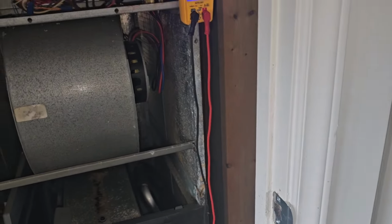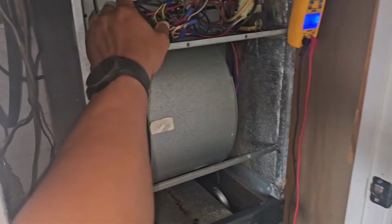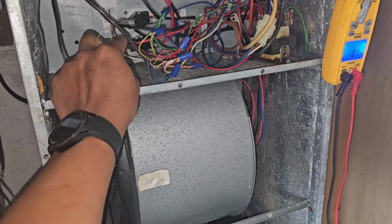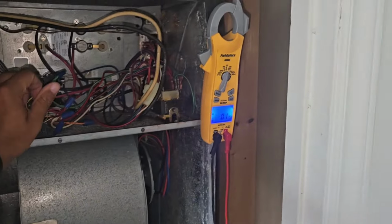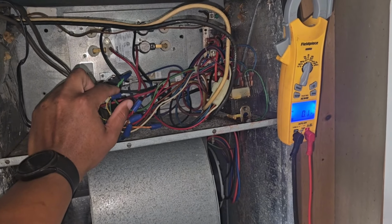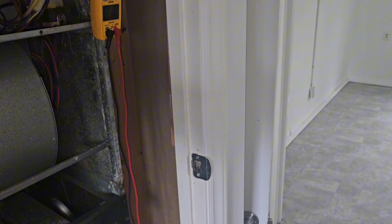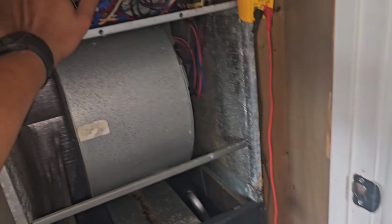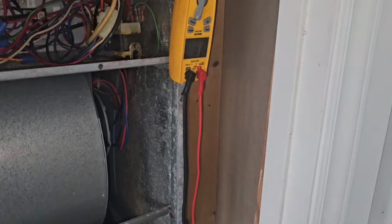You cut the fan on? I think the fan relay on the board is bad. But what happened in heat mode was that the heat strips also energized the blower motor, like the sequencers do, for a certain fan speed, if I'm correct. Some units do, some units don't. It could be controlled still through the fan relay on the board. But that would explain why when we had it in heat mode and we bumped it up, the second stage heat kicked on the heat strips, and the heat strip sequencer kicked on the blower motor. Because that thing was running just like 40 something and 200 something.